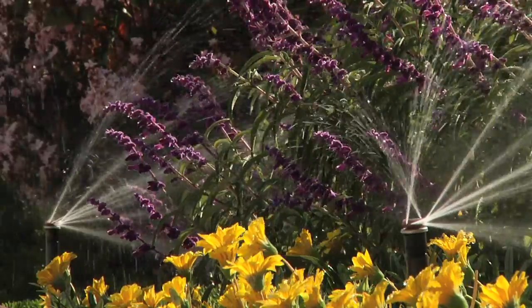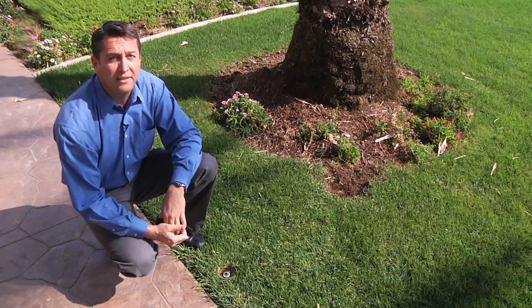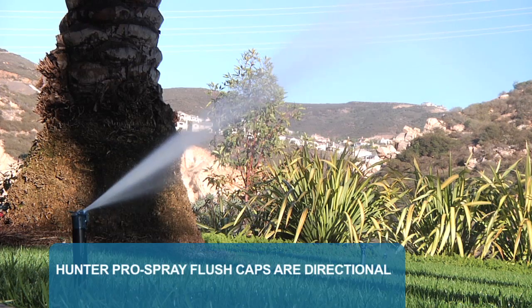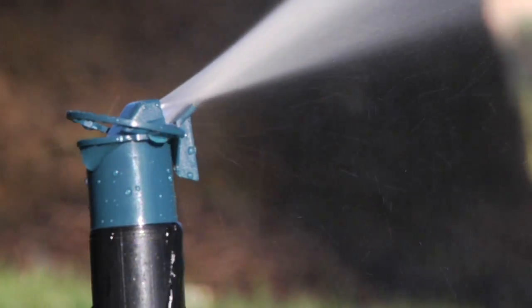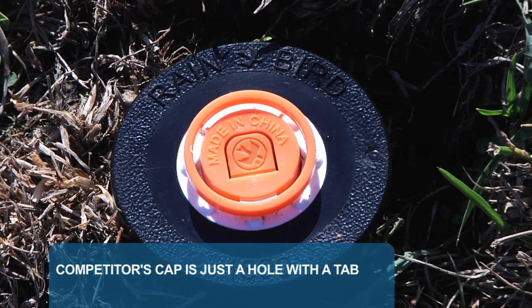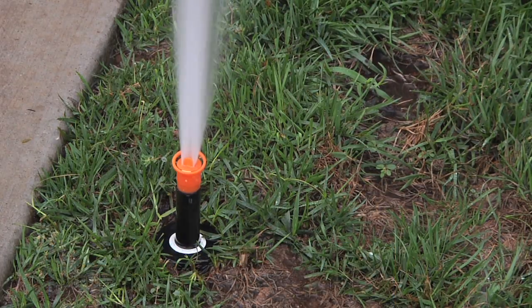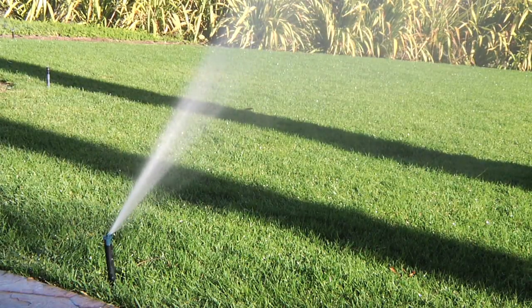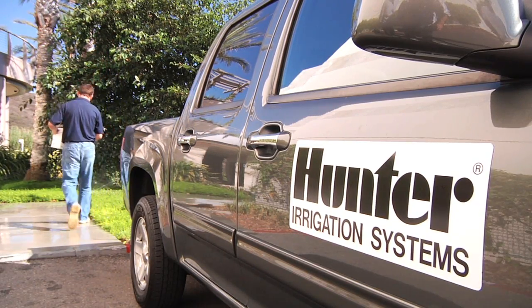It's time to do some field tests around installation of bodies. With Pro Spray bodies, Hunter took everything into account, including the routine task of flushing the spray body. The Pro Spray flush caps are directional to allow you to control the large stream of water towards the location you want. Simply point the cap to where you want the water, flush the system, and there will be no water mess at your location. Competitor 1 and 2 caps are just a hole with a tab — there's no ability to control the water when flushing the system. Water flies up and you're left with a mess. Hunter's Pro Spray flush cap is another way that Hunter listens to our contractors in the field and constantly improves our products with an irrigation professional in mind.